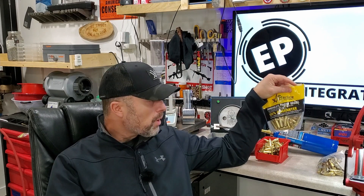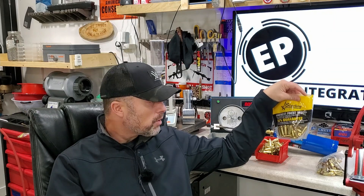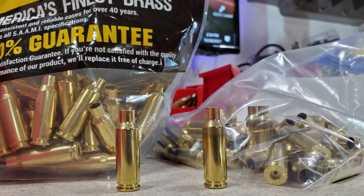A quick note: when you anneal, brass shows annealing marks differently. Brand new brass or brass that's been sitting in a bag for a while will show really deep, rich anneal marks. On the other hand, brass that you just cleaned and dried more often than not is not going to show an anneal mark when you anneal it — it doesn't mean it's not annealed. That's why I personally like to use the glow method. Just because it doesn't show an anneal mark doesn't mean it's not annealed.